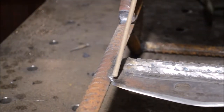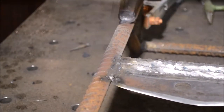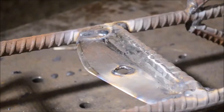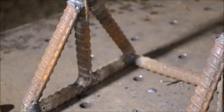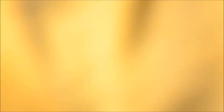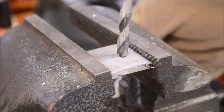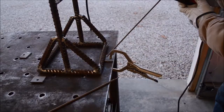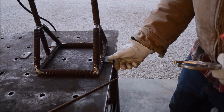Looking pretty good here. I had a little trouble striking my arc — didn't have good ground. When you're working with rusty metal like this, I normally just have my ground clamp on the table, but you actually have to move it to the piece. This was probably the toughest part for me — welding this center hole. I've always struggled with trying to fill holes and not blow through the product, but I eventually got it down, got it filled in, and ground it down. It looks pretty decent.